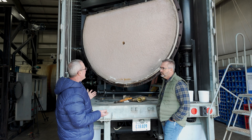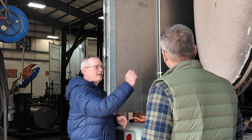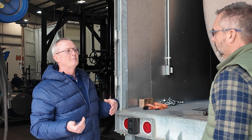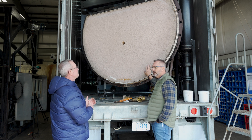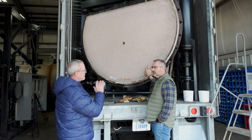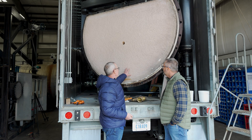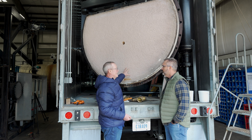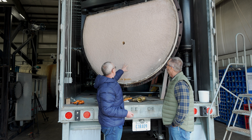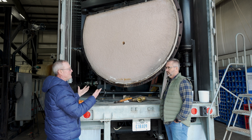The other thing that people like to do is they want that door to look pretty, so we have stuff called seal coat. They seal that off. Don't put that seal coat on there until the first time you do your turnaround — first time it's been running for a year, you open it up and want to put a seal coat on it, okay, then you're fine. What is that seal coat actually doing? It helps the refractory reflect that heat instead of absorbing it, so it just protects the surface. After a period of time it will start to turn to a little bit of a powder because of that 2,500 degree fire slamming into it all day long. It will deteriorate over time, and that seal coat protects it, helps reflect that heat, makes the door last longer.